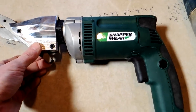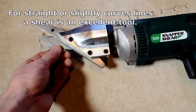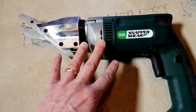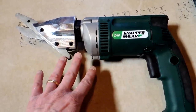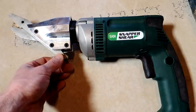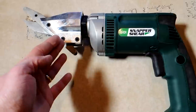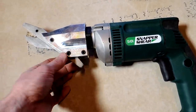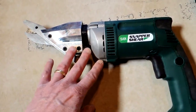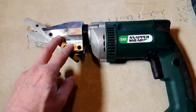The fifth method is to use a dedicated shear — this one's called a Snapper Shear, designed for fiber cement. It's got a special head on it and I'm going to demonstrate this as well. This works great with very minimal dust, which is wonderful. You can cut a nice clean straight line with it. Curves are possible, although not as easily as with a jigsaw. The downside is it's a dedicated tool, fairly expensive at $180 to $250. For a homeowner, you'd probably want to rent one rather than buy one. For a pro, it's definitely worth purchasing.